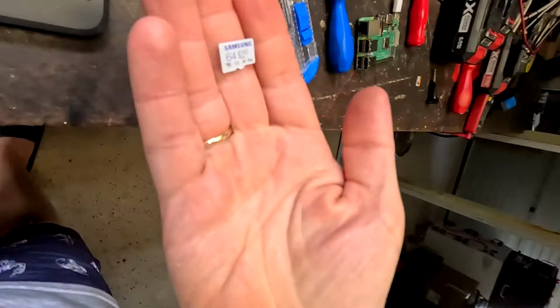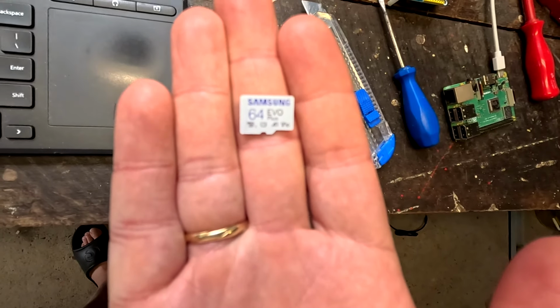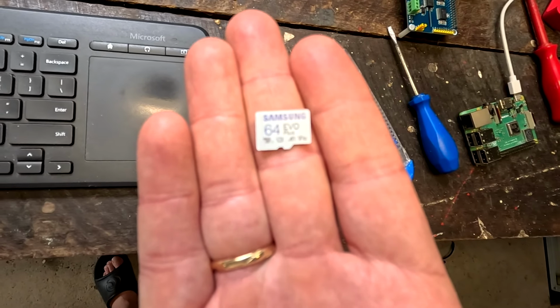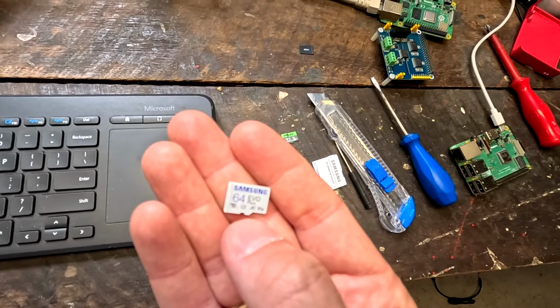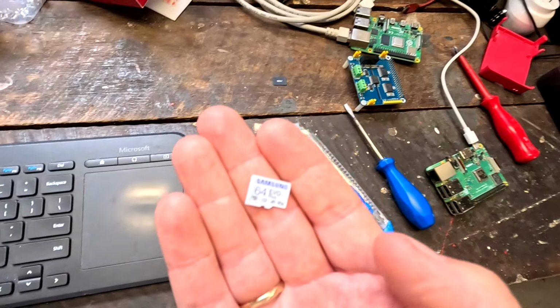And for some reason, it also crossed my mind that there is an SD card limit for the Raspberry Pi. And I quickly looked it up, and sure it is 32 gig. Maximum SD card support for these devices. So, and potentially my mistake was to use a 64 gigabyte SD card where I flashed the Venus OS on and also the Raspberry Pi OS for testing these Raspberry Pis.